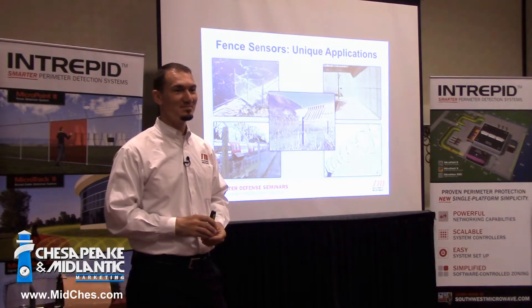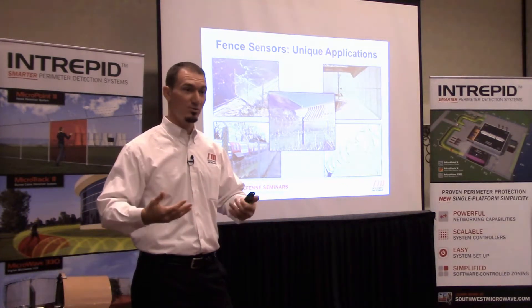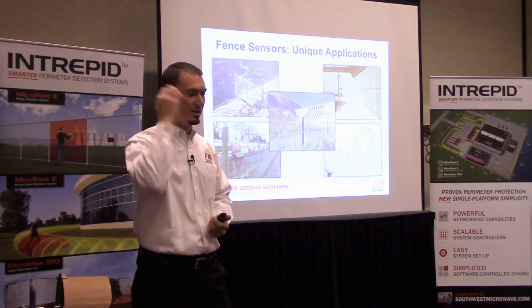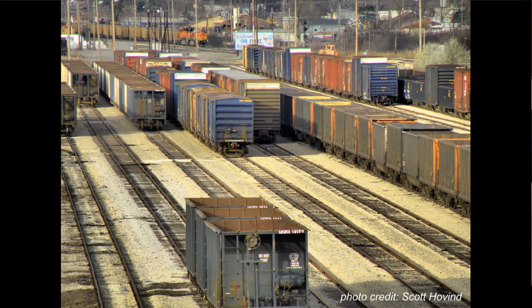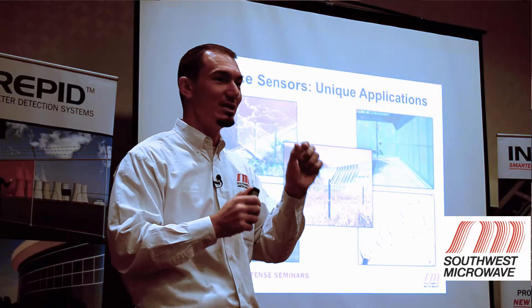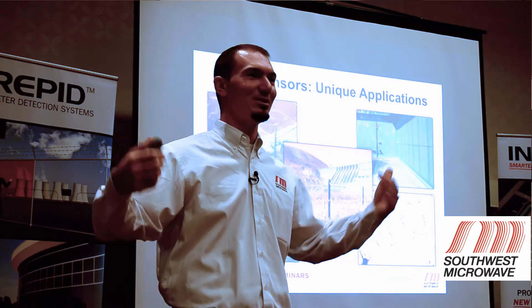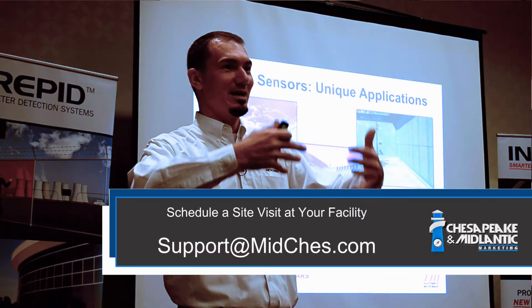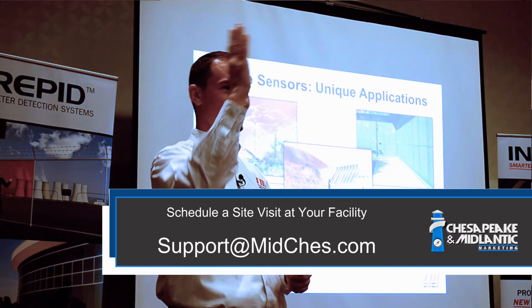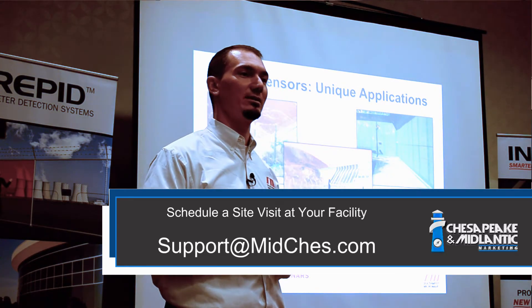When you see the trains go by — is it vibrations? Yeah, vibrations coming through the ground. A lot of times we have these at shipping terminals, and they have shunting yards nearby. A shunting yard is where they build trains — where they take train cars and attach them together. They move those over and attach more train cars. Every time they back up a train, all the cars compress by about half an inch — boom, boom, boom, boom. You can stand on the ground and feel it shake when they're doing that, and then they stop and all the cars expand a little bit. You can watch the fence kind of shake along there. Generally, it's that vibration transmitted through the ground and metal-on-metal contact that's generating those issues.